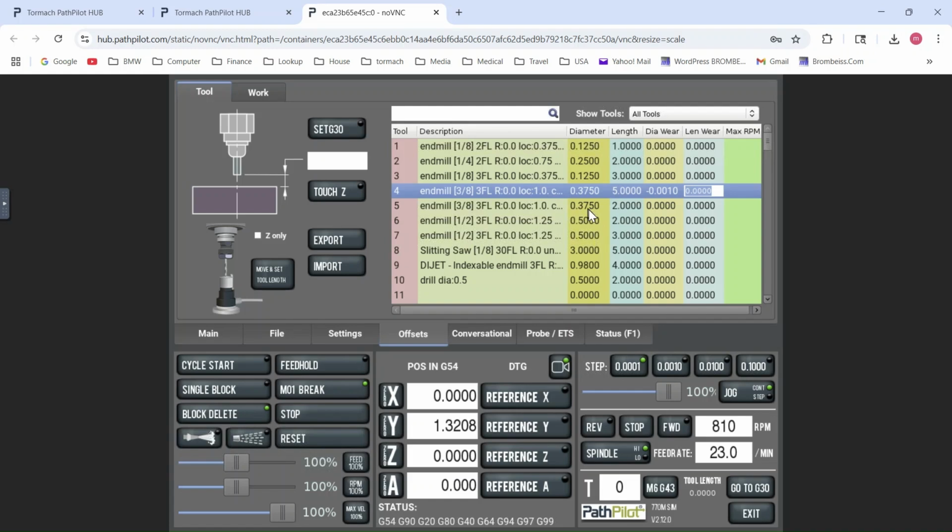For operations where you did not pick cutter compensation wear, all these numbers are completely irrelevant. It does not matter what you enter under diameter or diameter wear. Fusion and PathPilot will take the values specified in Fusion. Only for operations for which you indicated compensation type is wear are these numbers relevant.